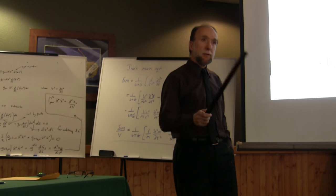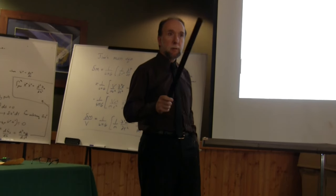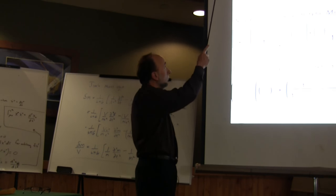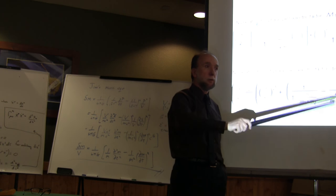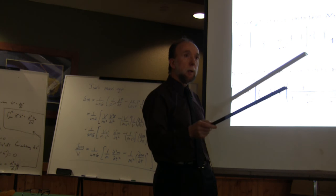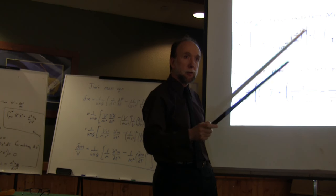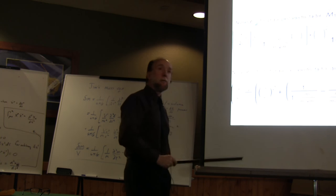I have a couple of slides at the end. I think there's a better way to do this, which is to run impedance spectroscopy. Okay. You run an impedance spectroscopy, on the vertical axis you have impedance, on the horizontal axis you have the frequency. How long does it take you to run? Try to keep it at a constant level between runs. It puts noise into the device. Seconds. It takes 2 seconds. In 2 seconds, you get all the information you want.